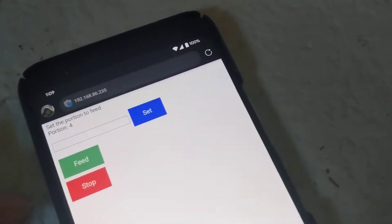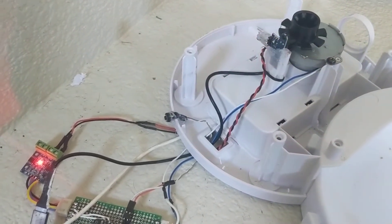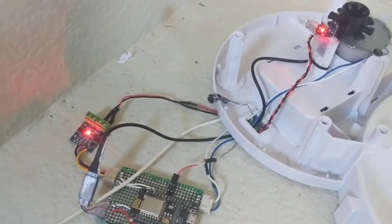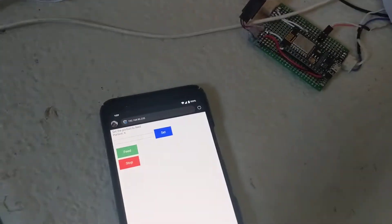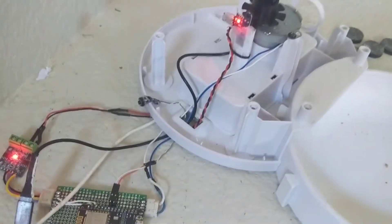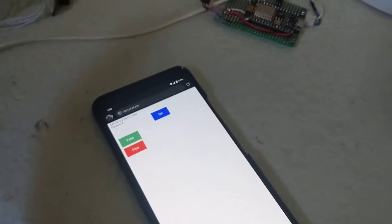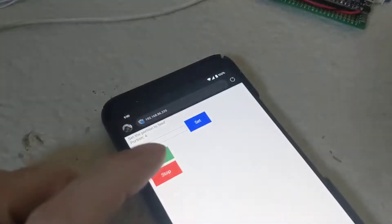The code is just Arduino running on the NodeMCU as a web server. I've configured it to four portions — so it should rotate about 12 times, since four portions times three revolutions each equals 12. The web interface has just a couple of buttons. I put a stop button in case I made an error in the code and the motor just keeps running — it's an asynchronous call that updates a variable to control whether it's running, basically turning it off. It's a way to interrupt it if it gets into a runaway state.